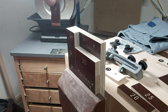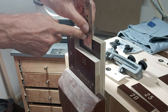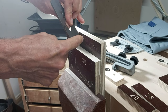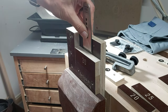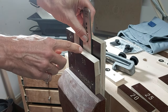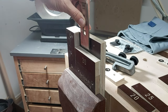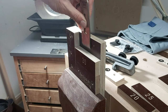I've swung the camera to the side to show you one potential problem. When I'm putting the plane iron or chisel into the SE77 jig, I want the flat side — the back of the iron or chisel — against the wood here. But because of the wedge action when the chisel comes down, it could push this block forward and I wouldn't get the right projection. So I need something that pushes the chisel or plane iron forward so it makes contact more in the middle of this surface and can't wedge it out.